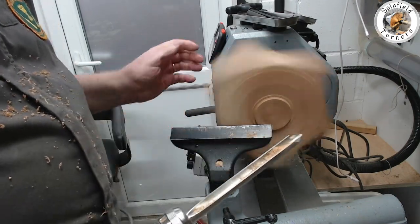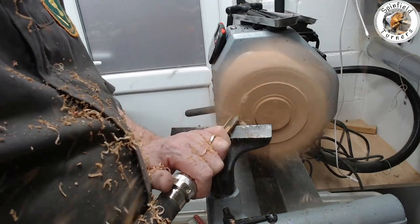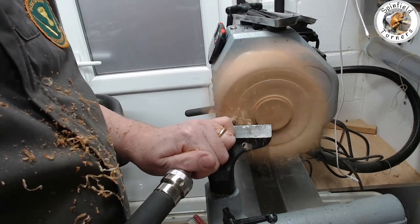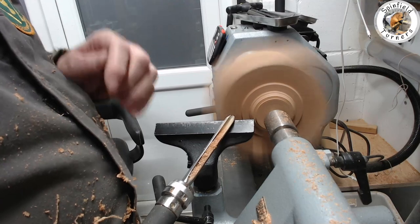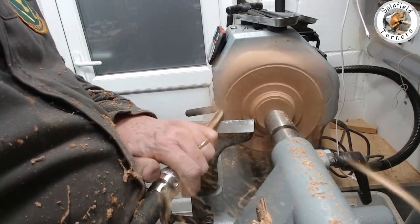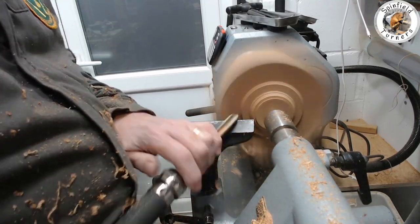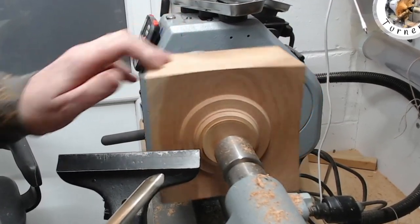I'm now using a 3/8 bowl gouge as a push cut to cut the air first and push in to keep those corners nice and crisp. I want a nice flat edge and nice square points - if you do a pull cut too soon coming back across the air you just shatter those edges. As you push in from the outside, make sure the bevel of the front face of the gouge just gently kisses the wood. Speed is your friend - I'm running at about 1200-1500 RPM. There's a bit of woodworm on the corner but we're getting there.